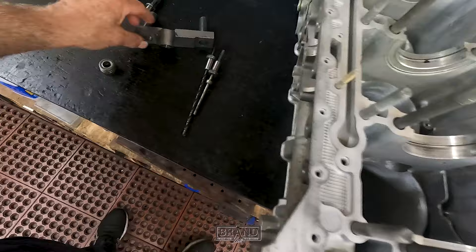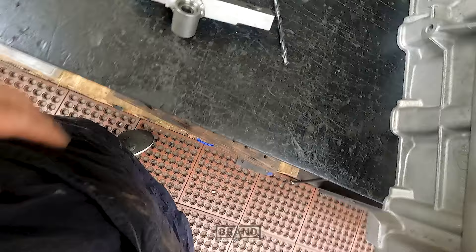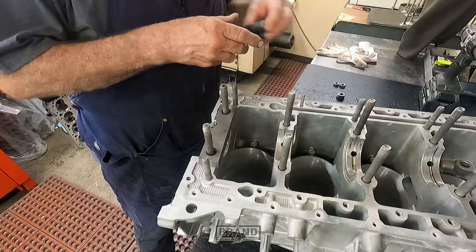The fixture I built drills the hole in the same location here. It's a fixture that has drill bushings in it. There's a little step drill, then the main drill, and then the reamer. I'll show you how to do it and explain a little more as I go.